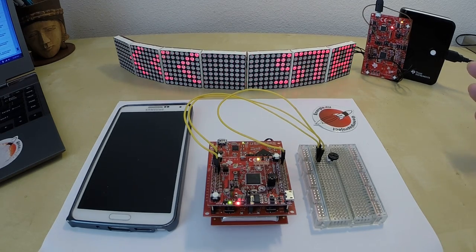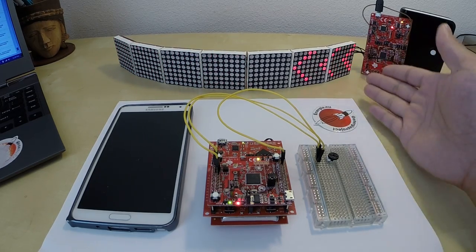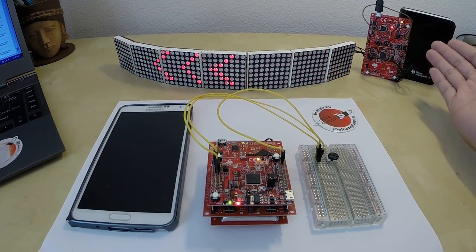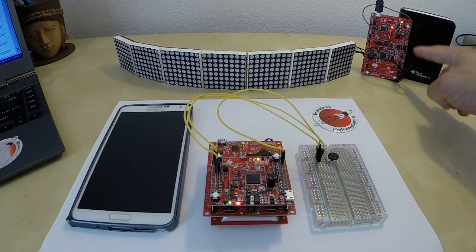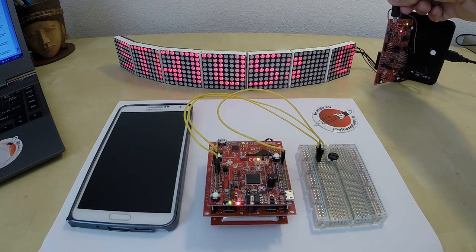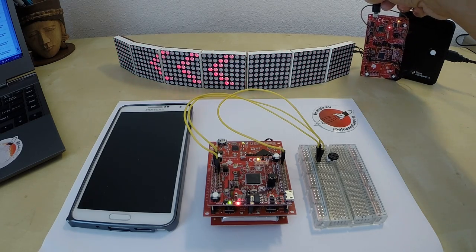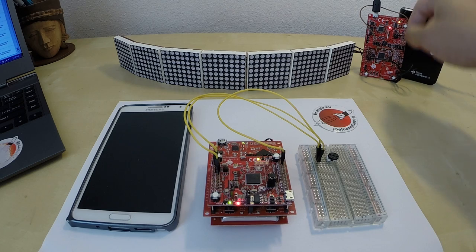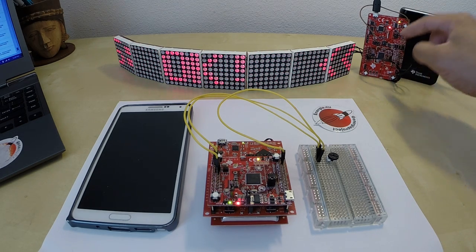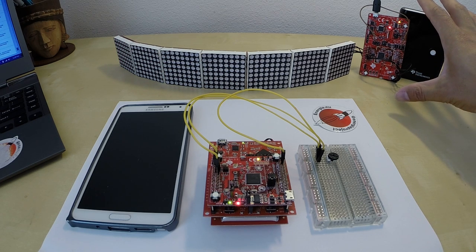And in the cloud, I'm actually triggering various events. So the first event that I actually trigger is sending a status-okay sort of message to this Wi-Fi Launchpad. So this is the CC3200 Wi-Fi Launchpad. It's, I think, $30. It's a single board, and it features the new CC3200 ARM microcontroller plus Wi-Fi transceiver all on one chip.